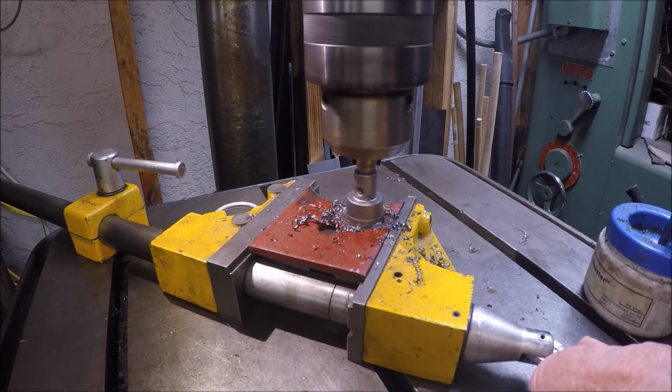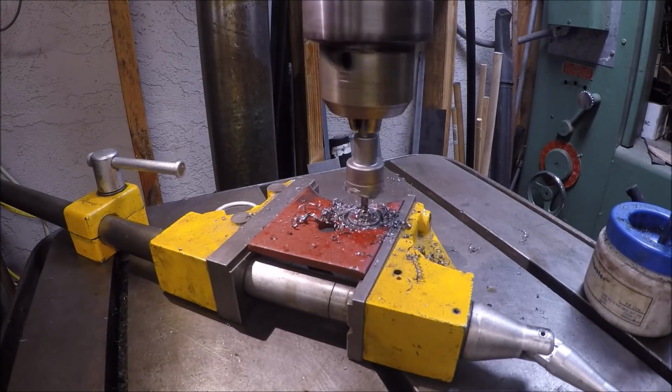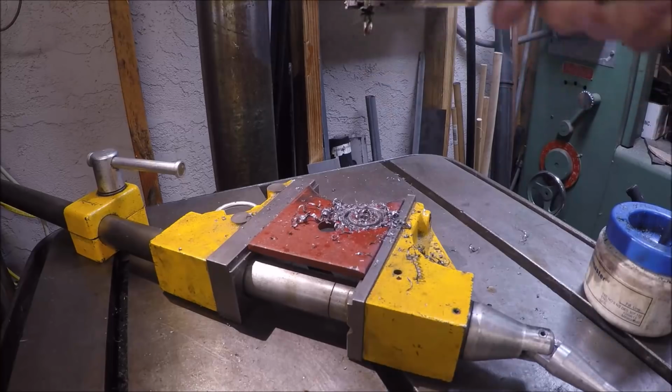Seems to be cutting well, and I did not pay attention to what was taking place. Basically, you have saw blades there, as you can see, it's cutting very, very well, and it's progressing. Well, what I didn't pay attention to, and I saw it actually, is that at some point the blade quit cutting and it was starting to grind, and you could actually see fine grinding.